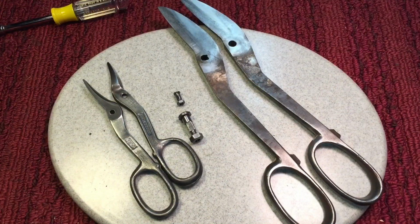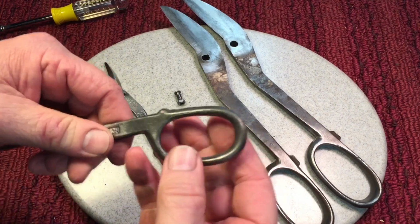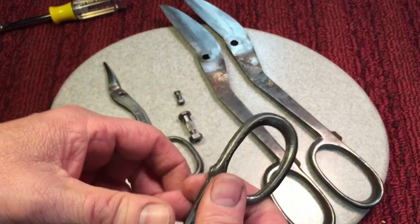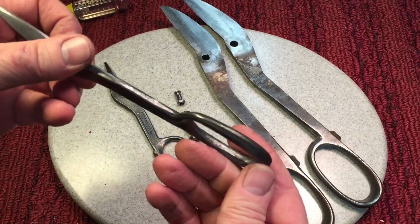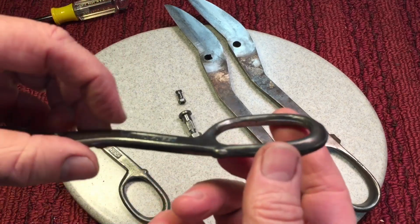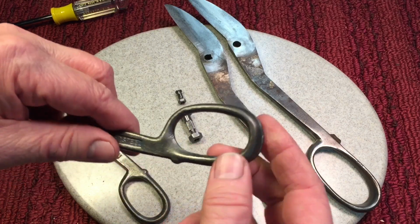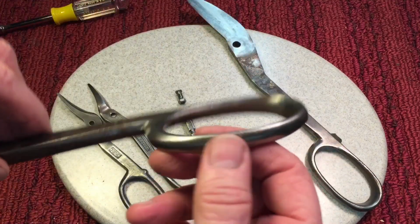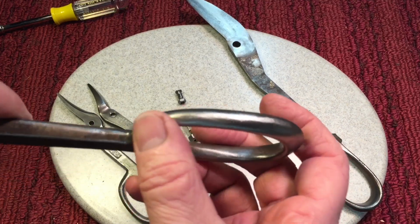Okay, here's our post-wire brush evaluation. Now, a couple things to talk about here. You can see around the handles, you see that big forging seam here. Anytime your hands are in the area around here, you want that smooth, and these lines have got to go. Also, you can see they look almost primitive. I'm sure they just ground it out, maybe used a die grinder or something just to take off some initial flashing, and then that's it. They dip it in some paint. You can see it over here too, it's a strange look over here.